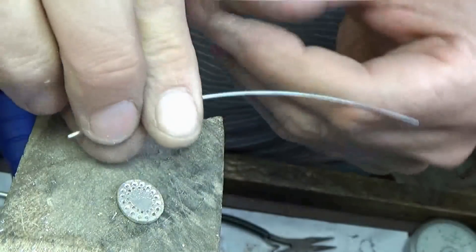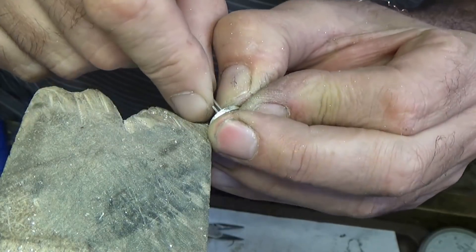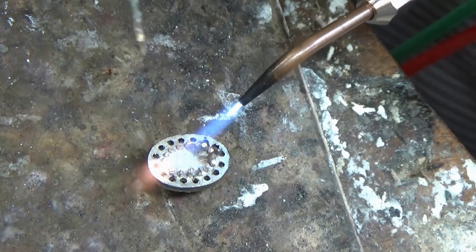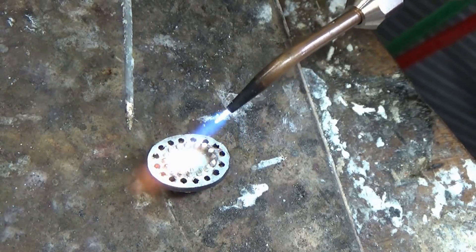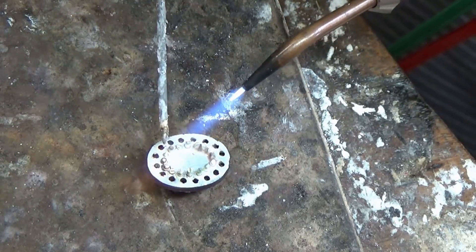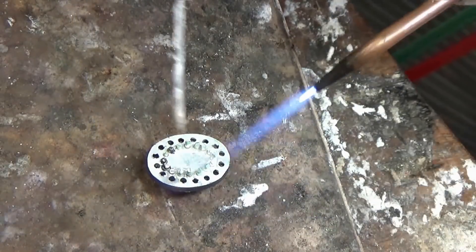Before I finally push the claws in I'll just make sure that the wire is nice and clean ready for soldering. I'll just fit them one by one now. The wire is exposed so I'm just going to melt the solder right on top. I can apply direct heat there and then just allow it to run around. It might be the case that the solder will jump over to the next one. Try not to put too much on though because I don't want evidence of solder on the other side.